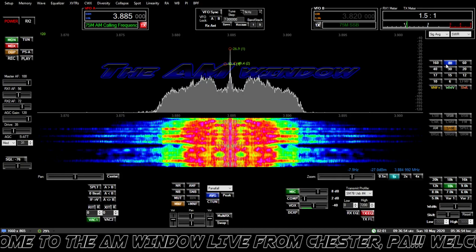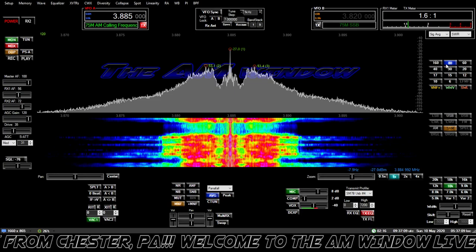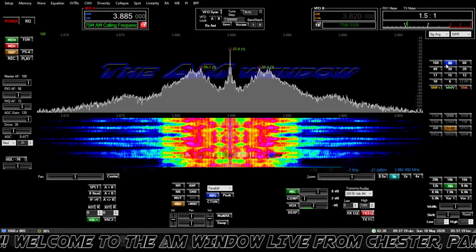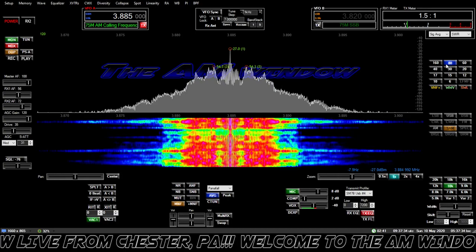Dan, like you said, there's more propagation normally when we're on the uptick as opposed to on the downtick there. So let's hope this next cycle is gangbusters. And I did some 10-meter work a few weeks back and worked some South America stations, Dan. I have a 4-element 10-meter Yagi, a Sirio, just mounted on the roof on a tripod, and it works good. I worked the guys down south with no problem, and was working South America with it. I do need to put a new rotor up.